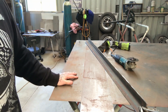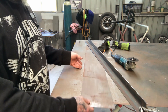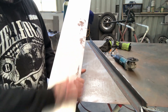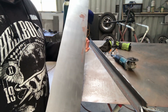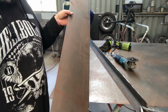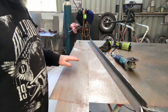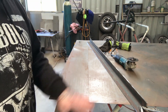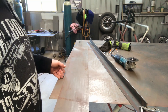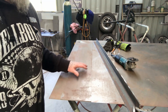I don't normally use cold rolled steel - I normally use zinc anneal because I'm in Queensland which is humid and gross. You can see this side of the metal is quite clean with a bit of surface rust, but that's how it comes. In the week that this has been sitting here as a bench, you can see how much rustier this side is because it's been more exposed to moisture in the air. But I thought it would be good - I can show you how to clean the surface with both a clean and strip disc and also a phosphoric acid-based rust converter.